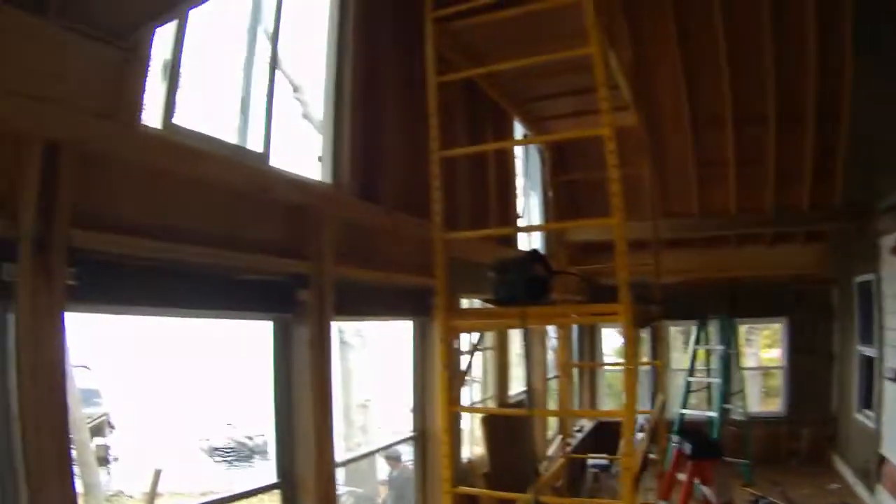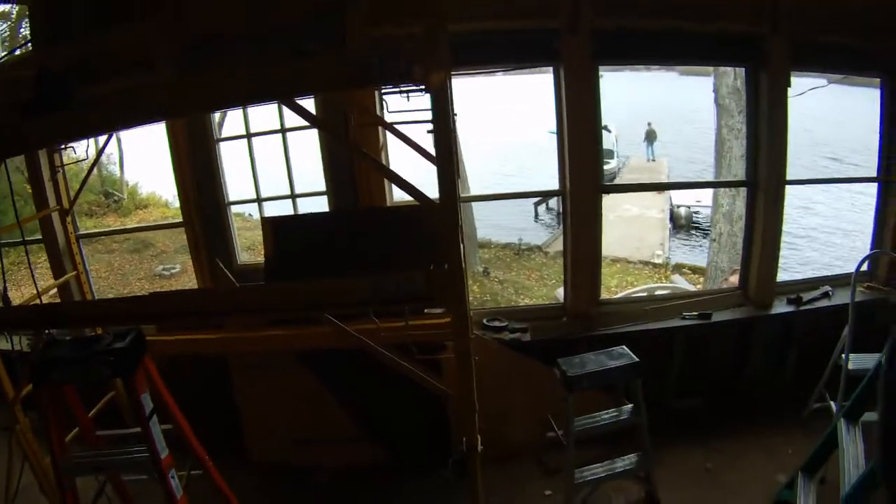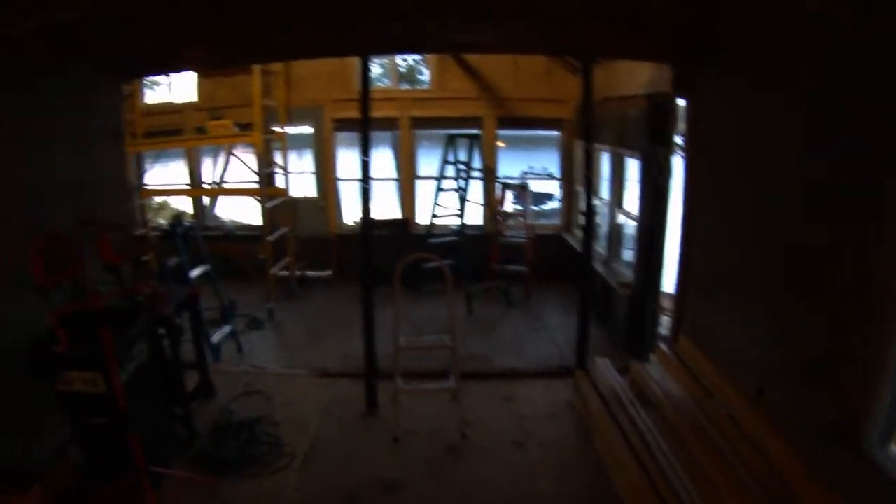With a little light in here, we can see exactly what's going on. We'll be putting a laminate post up high and raising these up, taking all the windows out. Today we knocked out this wall and have a couple of temporary posts holding the weight. We'll be putting a laminate beam in here with two laminate posts on each side.